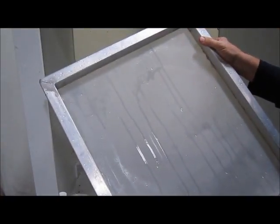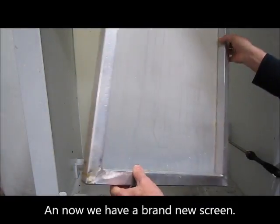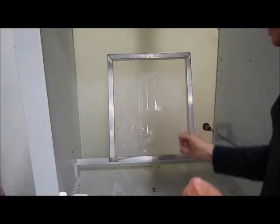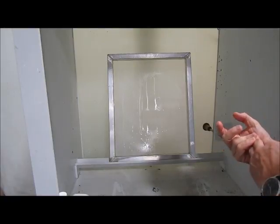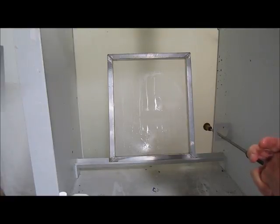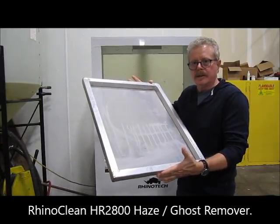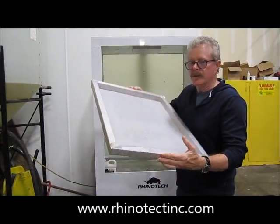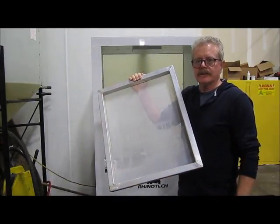And here we have it — we have taken out the ghost image completely. It is like a brand-new white 125 mesh. The nice thing about this is some people will try to do this kind of thing with just a hose and a haze remover or ghost remover, but it's the pressure washer that really helps because it gets into the knuckles at the crossover points and breaks it down. So here we are — HR 2800 haze remover, thick liquid, stays on the screen where you put it even on a wet screen, takes it out, it is like having a brand new stretched screen. Thank you for watching — you know where to find us — until the next time.